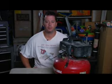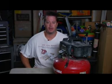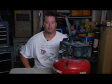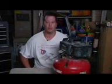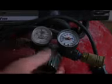Today I'm going to show you how to adjust an air compressor regulator. One thing you need to remember about using air tools is that some of them require different pressures to operate efficiently. Nail guns, that type of stuff, you're going to want to use anywhere from 90 to 120 psi. If you're spraying using a texture hopper or something small like that, it's usually around 25 psi.